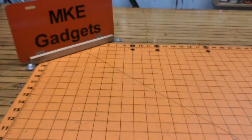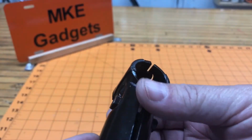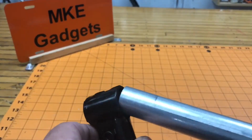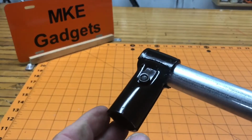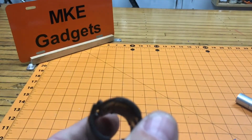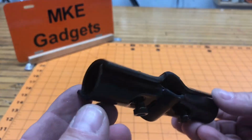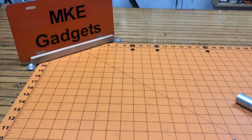So the outlet will go in the box, and on top of there, a nice polished cover. Now maker pipe, if you're not aware, is these fittings that fit on 3/4 inch conduit. They fit on the end, or the conduit just goes in here. We're gonna use a few of these today. So this is a 90 connector, and this is a 180 connector. We might use a few more. We'll kind of see how this goes.